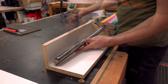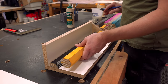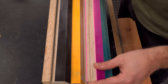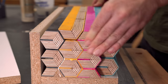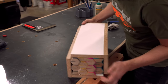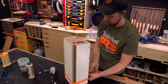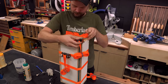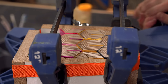I made two identical jigs with a little triangle at the bottom so I can rest the pattern upright when done. Then it was just gluing each individual strip in, making sure they were nestled well between each color. I stacked the colors in CMYK order, and you can see how much the edges extend the pattern. I stood it up with both sides on and added ratchet straps, but ended up adding clamps too because I wasn't getting enough squeeze-out. The clamps helped a bit, but I just had to wait until the next day to see whether it worked.